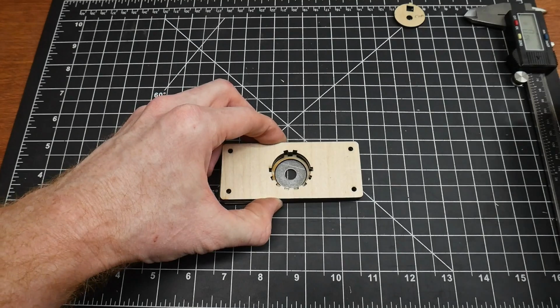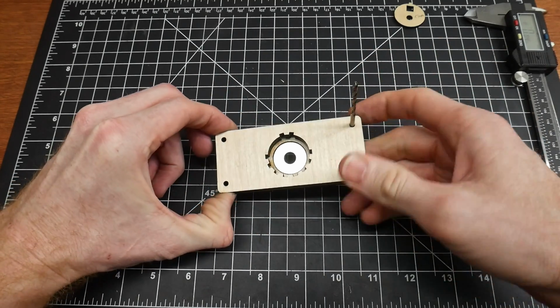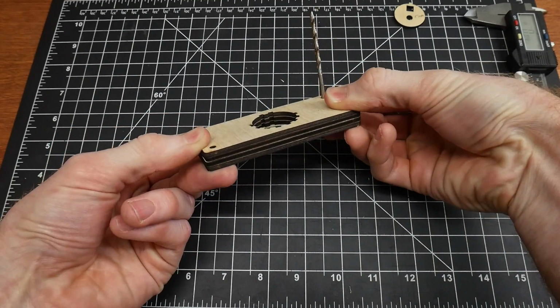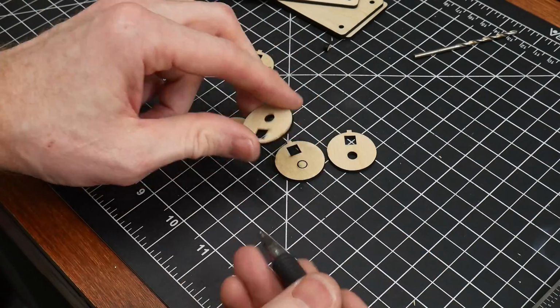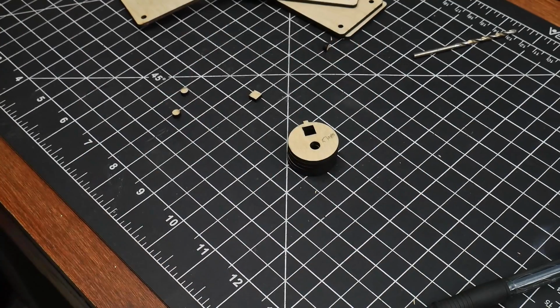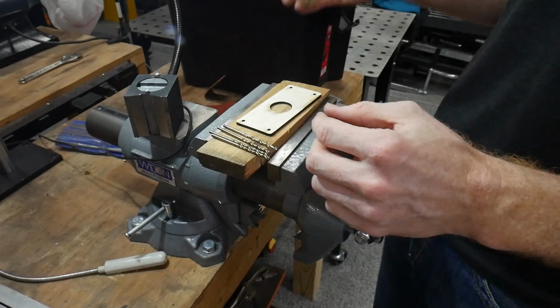The base plate was designed for common 8mm washers. These washers list an outer diameter of 24mm, however I found them to be a little smaller. The jig y'all are seeing here is actually the 3rd iteration of the design, since I had to cut multiple versions to get all of the dimensions right. You'll see later that I ended up hand filing a few pieces briefly to fit up just right.